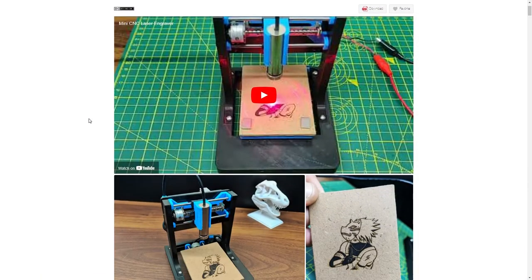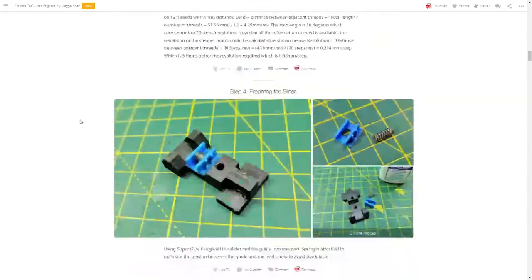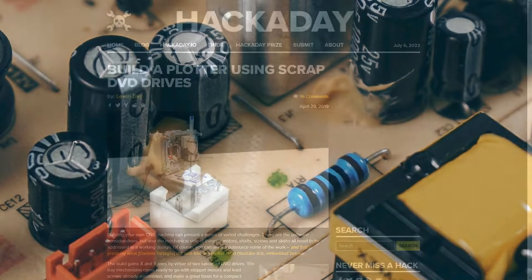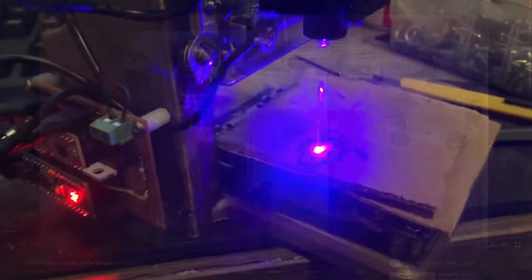I did follow an Instructables tutorial for the electronics, which I'll link down in the description. The main parts consist of a cheap laser, two old DVD drives, an Arduino, two stepper drivers, and some electronics. This could be built using some wooden scraps, but since I have a 3D printer and too much spare time, I just designed and printed something that fit the stepper motors with their linear rails assembly.